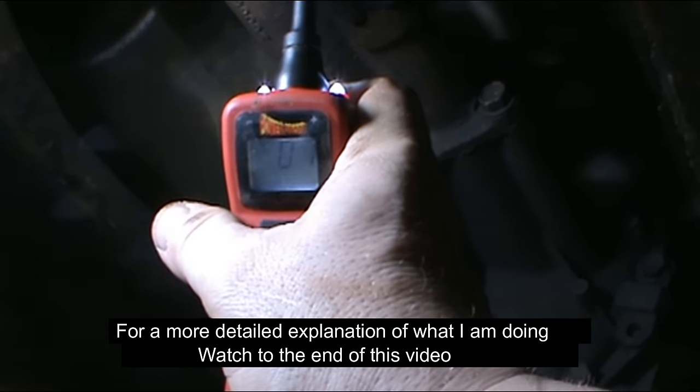You can even go straight to the battery, which is what the power probe does — all the power probe is doing when you touch a wire is checking for power and checking for continuity to ground. We got nothing. But if I take this piece of wire and add it — touch it back to the frame of your vehicle — boom, there's our lights again, because we got a good ground again. Because the whole frame of your vehicle is connected directly to the battery ground, you could touch it in any spot and get ground.